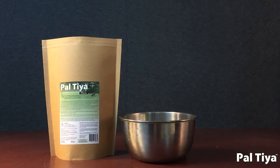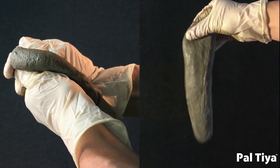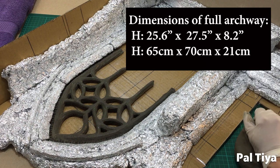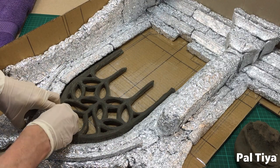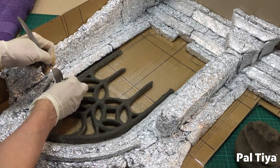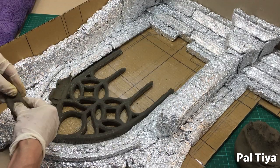Begin by mixing more Paltaya Premium — it should dangle just like this. The dimensions of the archway are on the screen. We're securing the scratch coat that we left on the tracery window by pressing the Paltaya Premium deeply into the grooves. This will ensure that it survives any freeze-thaw.